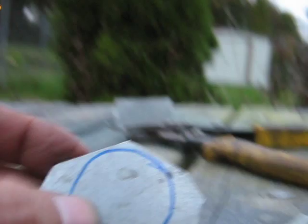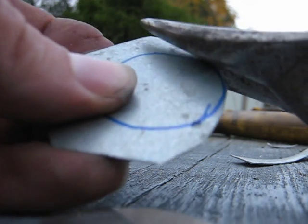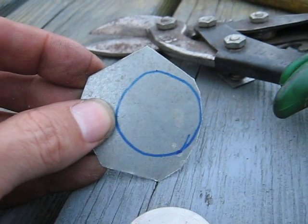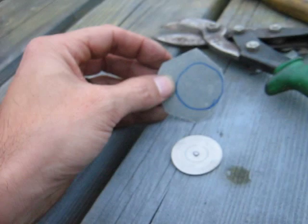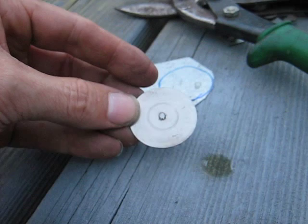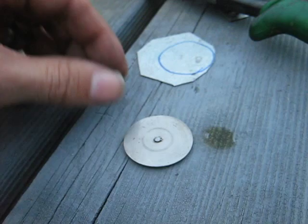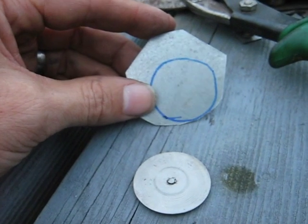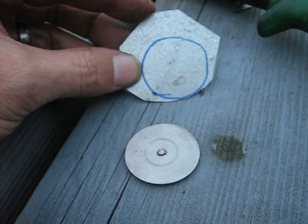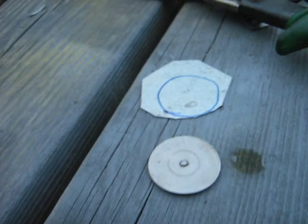You'd want to do this all the way around as even as you can. You can basically make a hundred sided stop sign if you want. Then proceed to file it round or whatever — not everybody's got the same tools, so you don't necessarily have to spin it in a drill like I did. Once you put that hole in the middle you have to plug it. The object is you want your valve to be flat. Round is kind of a secondary thing because the valve doesn't need to rotate in the piston valve, but it does indeed need to be flat to seal. Just wanted to show you some of my sheet metal work there.